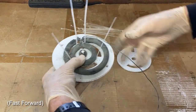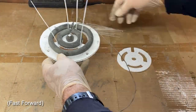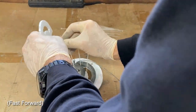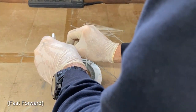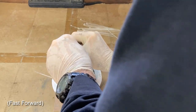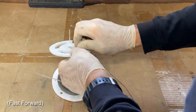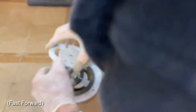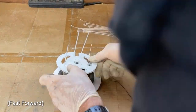Position the stacker coil and the GANs ball over the stacker tray as shown. Then thread the cable ties through the holes in the stacker tray cover. Gradually lower the stacker tray cover and pull the slack out of each cable tie.